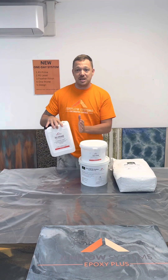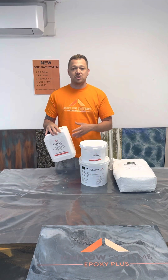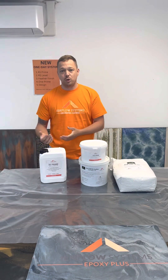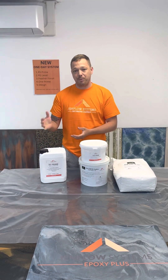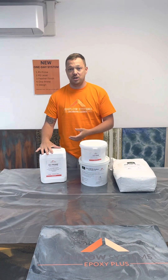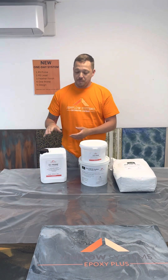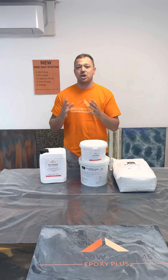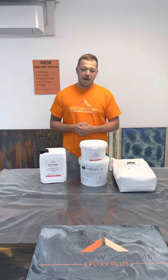Generally, it can go down as a neat product or you can cut it with water at 3 to 1. If it's on anhydrite or gypsum-based product, then you need to cut it 3 to 1. Do a coat of that and then once that's dry, you do a neat coat of this product. Prior to doing it, you need to do your appropriate sanding or grinding to create the surface profile — the CSP — prior to coating.